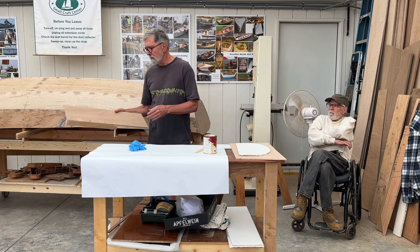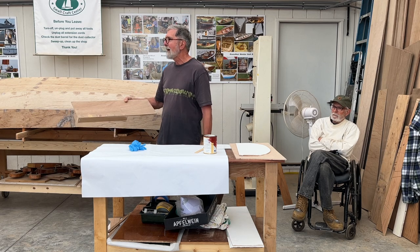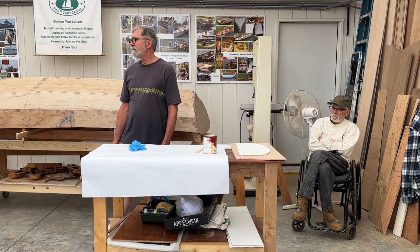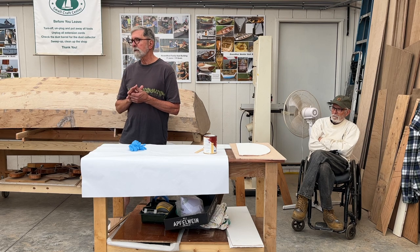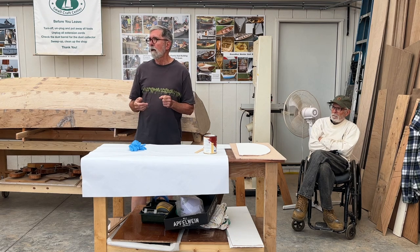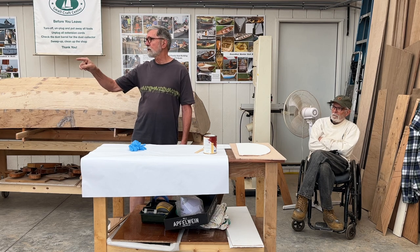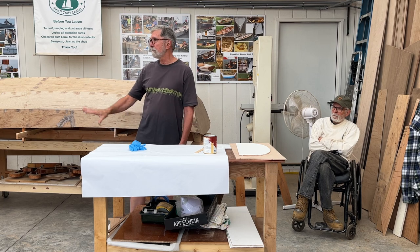If you're painting, you need to prep. You end up with holes when you build a boat and you've got to fill those. This shows several different types of filling material. You don't have to use marine fillers if your boat's not going to sit in the water the whole time — if it's a trailer queen, no big deal. This shows a couple of common hardware store fillers plus Quick-Fair, which is what's being used here. You can get a sense of how it comes out because that thing had a lot of holes in it.